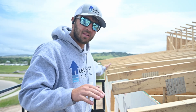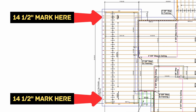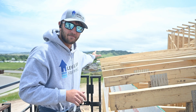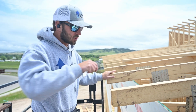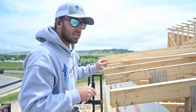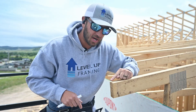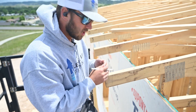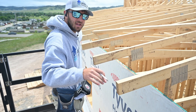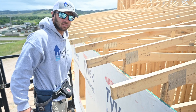To get all of our tails cut in a straight line, we're going to chalk a line from one end of the house to the other. This is a long run, so it's actually too long and too windy to chalk it once. We're going to pull it super tight to one end, then go down in the middle and carefully put our finger on it pushing straight down, and snap each side. We hold the chalk line over very tight so that it will average out and make a straight line between our 14 and a half marks on each end. So let's chalk it.